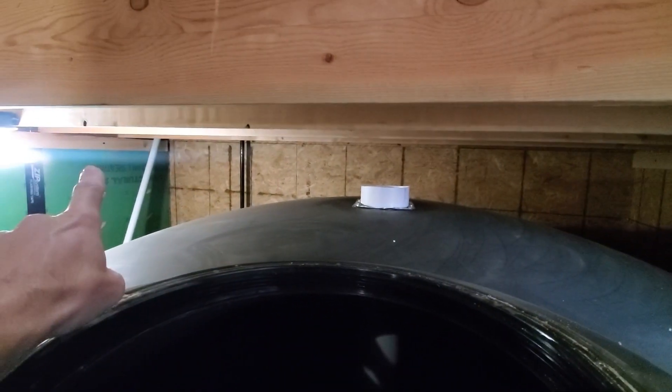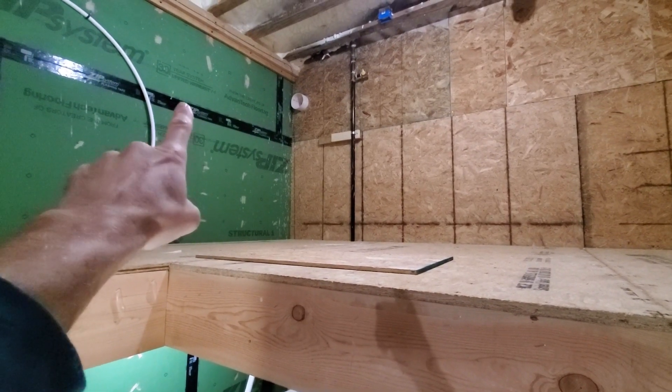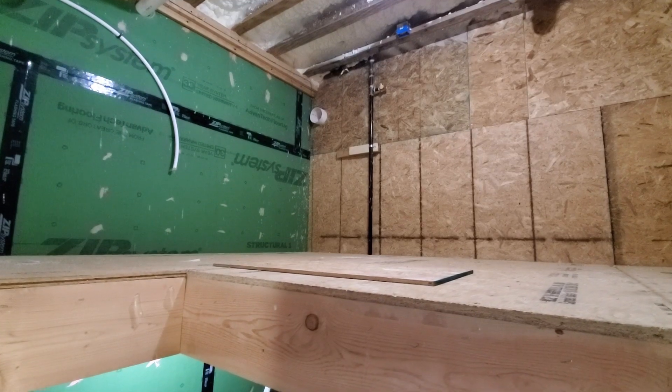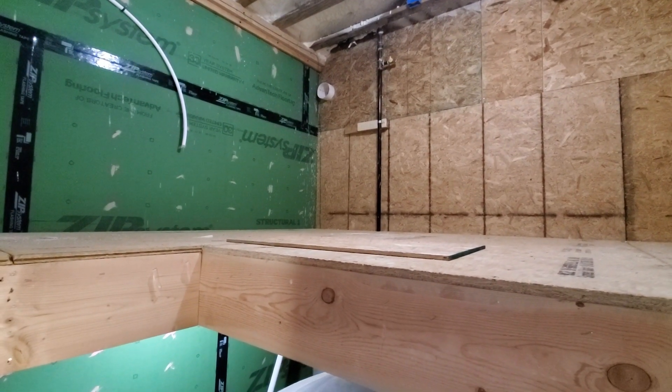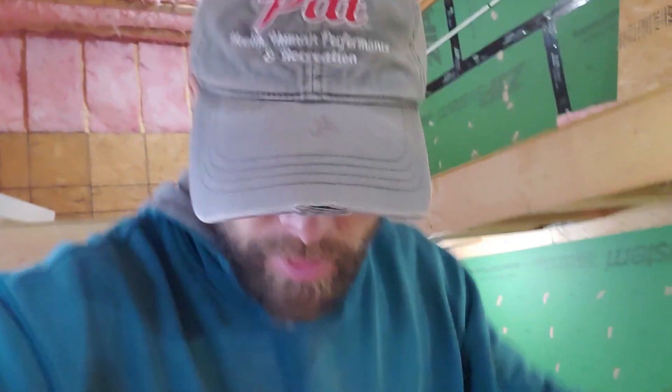On the top, my pipe is going to 90 up into the floor, come over, then 90 up through the floor and hook onto this pipe. Right about there I'm going to have another T where the top is open — I'll have a cap on it I can just take off. I want some type of filter inside the downflow pipe to collect any debris, leaves, and stuff that may get through. On the gutters, I'll put gutter guards to help keep debris out. With the filter in here, I should be able to pop the cap off, have a little rope tied to it, pull it up, clean it, and put it back down.